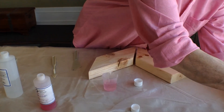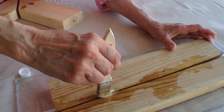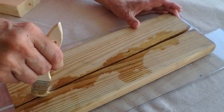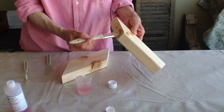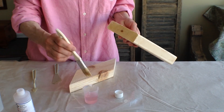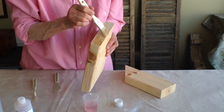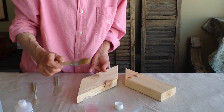Apply a liberal amount to the surface you wish to repair — in this case, an example of a split deck board. This gun and nozzle is also perfect for right angle joint repairs in soffits, fascias, and other places where expansion and contraction over time has created gaps in the wood. Repairing with ART FlexTech HV will close the gap for good because the repair will expand and contract with the wood.